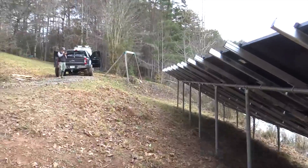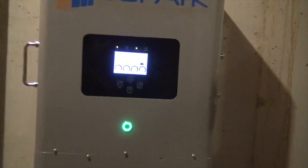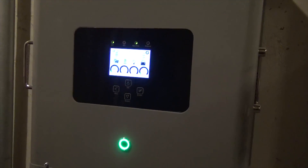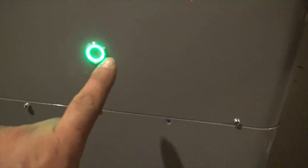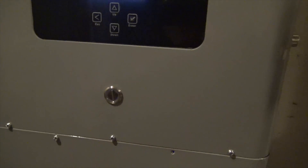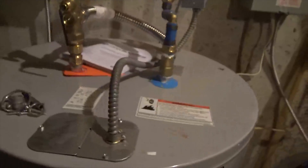We're not finished with this system yet, but we're going to shut it down. The battery came up about three percent in the last hour, just letting it charge on solar — only getting 500 watts. Wrapping up in the mech room; everything worked well. The shut-off button is here, everything shuts off — it's a very simple system. Going to turn the PV off and turn the breakers off to the battery. All those are off, solar is off, and it'll go to sleep here in a second.